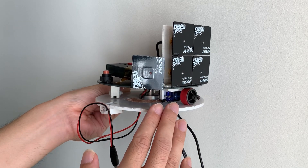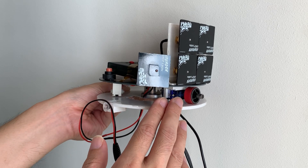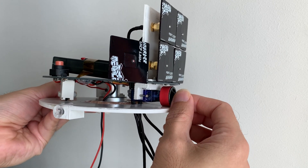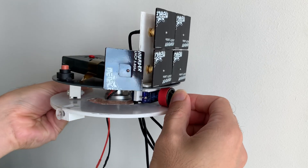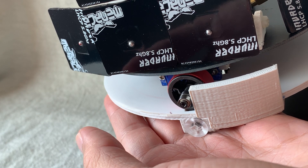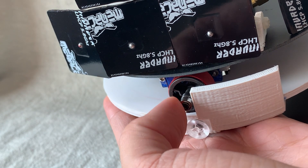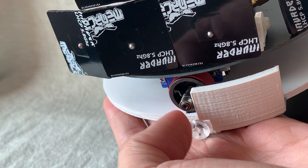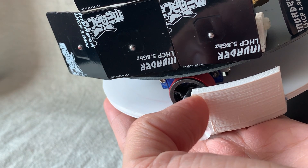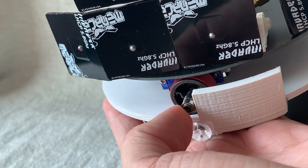The turntable is now mounted onto the tracker base. I've added the DC plug for supplying power to the entire unit, and the wires have enough slack so they do not bind up — everything turns freely with no binding. The final touch is to install the 3D printed travel stop. As soon as the wheel comes into contact with the one-way bearing on the tracker base it will spin on the spot, but due to momentum it will overshoot, so the travel stop prevents that from happening. The bearing is also there to prevent any wear and tear on the plastic.